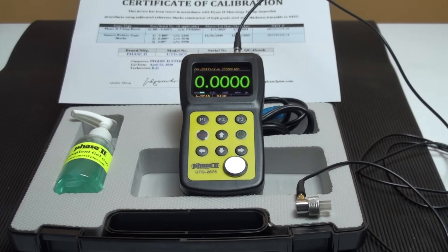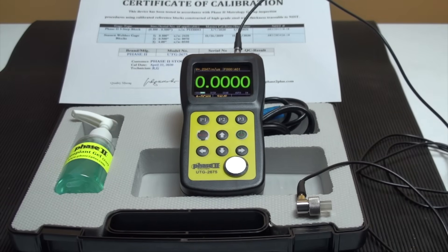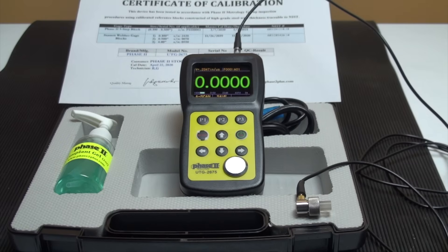The technology incorporated uses a high-quality delay line transducer for high resolution that transmits and receives sound waves. Generally, the velocity of sound through the material to be tested is a known value and is supplied via chart in the manual. In the case of the UTG-2675, we have preset the unit velocity to read steel, which matches the material of the built-in test block. You always have the option to manually preset the velocity of any material.